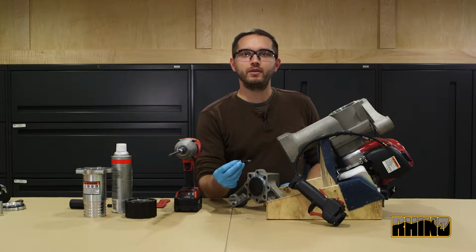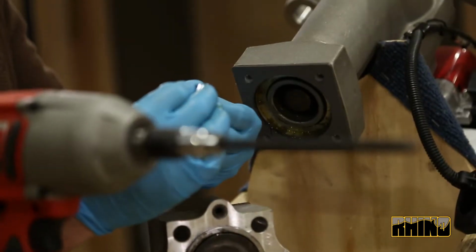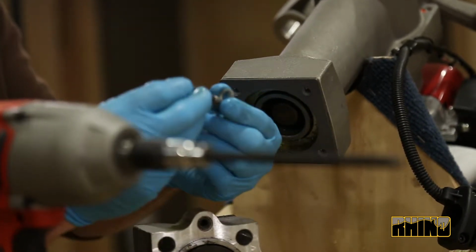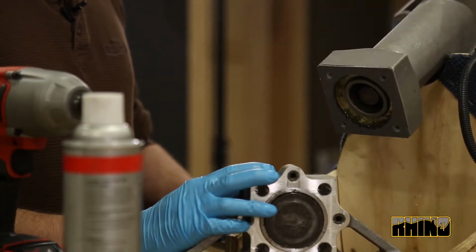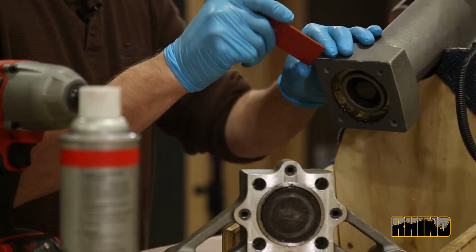on the Multi-Pro models, the bolts holding the chuck tube and the lower body have a 2-piece locking washer, and you'll want to make sure they are retained with the bolts for later installation. Once the lower body section is removed, you can remove the gasket using the scraper.